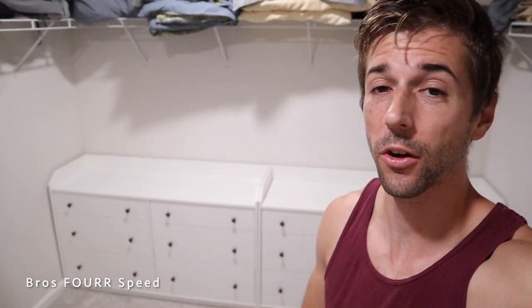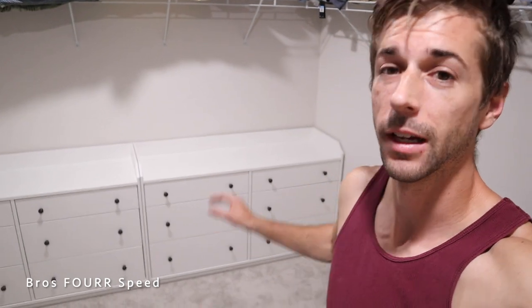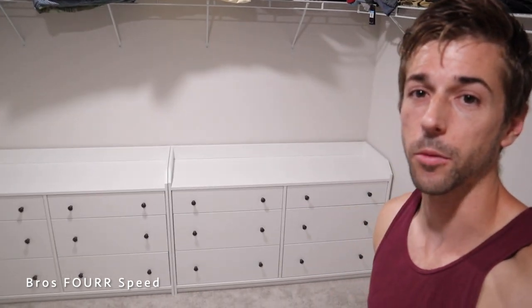Just like that, dresser number two is complete. This one took me just under an hour and a half. I hope that was a good step-by-step for you — you can use this for other dressers, desks, or anything you have to build from a kit; it's going to be relatively similar. Also make sure you measure where you want to put these before assembling; I measured before placing both on this wall so they would perfectly fit along the back of my closet. I'm also making another video about turning my entire closet into usable storage, so check that out in the description. Give it a thumbs up and consider subscribing so you don't miss our daily uploads!